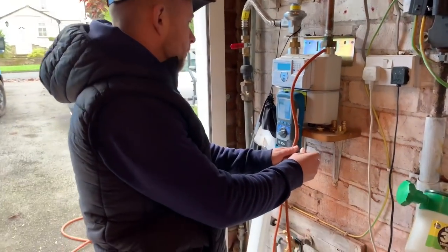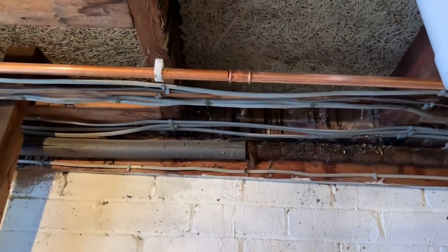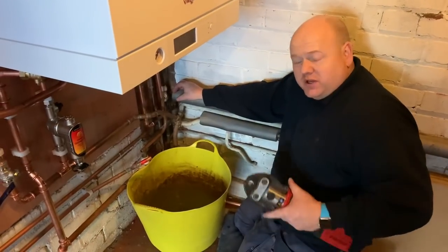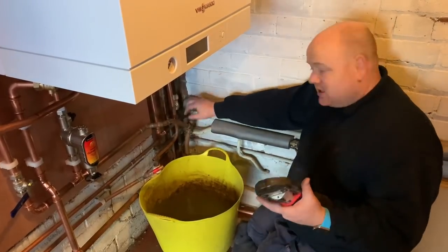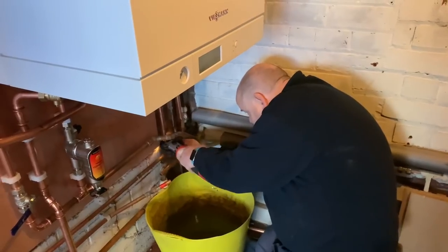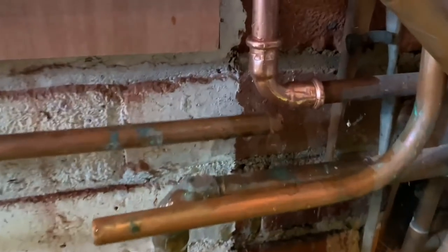Danny's just putting a gas test on now. We've just swapped the gas over — it's only taken us probably a minute or so, because we left it all ready to easily swap over. Danny's now going to put another test on now that the boiler is all fully piped up on the gas side. A really good thing with press-fit is we've got water running in this pipe and if we were going to solder this it'd be quite awkward. But because it's pressed, we can push this fitting on and just press it. And that's it — that's all sealed.